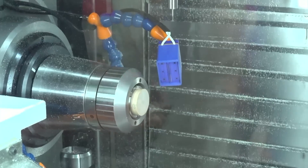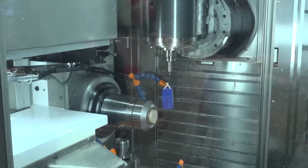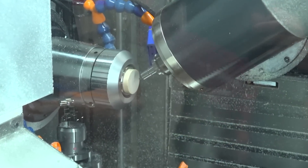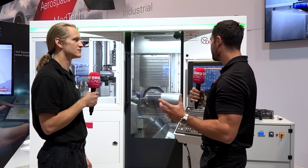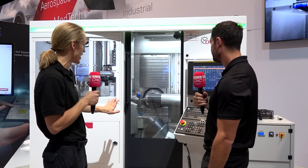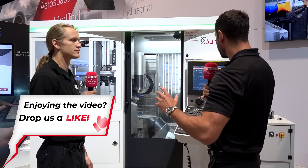This is a pretty wild machine. When we were first talking, you mentioned it's a sub-spindle machine, but I don't see a sub-spindle. Our sub-spindle is moving vertically, so we can have a compact machine with a better footprint. You have that 45-degree compound angle on your sub-spindle so it can swing around, tuck out of the way, and make room for the upper turret — that's what allows the smaller footprint. Yes, and the footprint is more and more important as real estate gets more expensive.